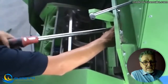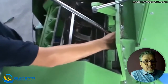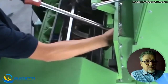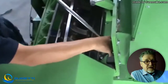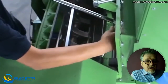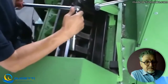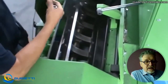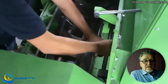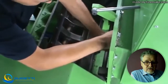This maintenance needs to be done regularly — it depends on your cable. Maybe once a week, maybe twice a week, and if you have really hard, rough cable it can happen also once a day. The better your knives are sharpened and set up, the better the results of the machine will be, and the higher the quality of the copper you can sell later on.